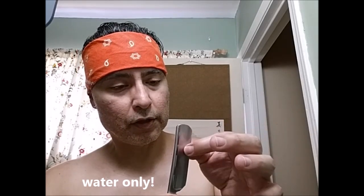Going to do a pass with the Gold Dollar 66 — just to see how finished the edges are. I took this through all synthetics, 1K through 8K, and then finished it on a Chinese 12K. Went at least a hundred laps on that stone. Didn't use any diamond spray or pastes after — just finished it, stropped it, and now I'm going to see what it shaves like.